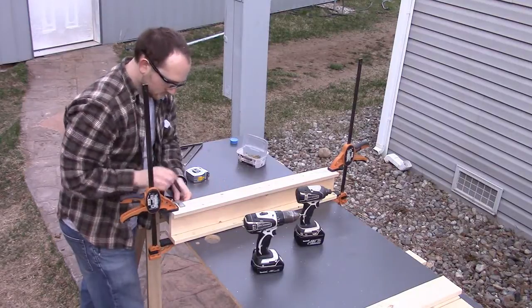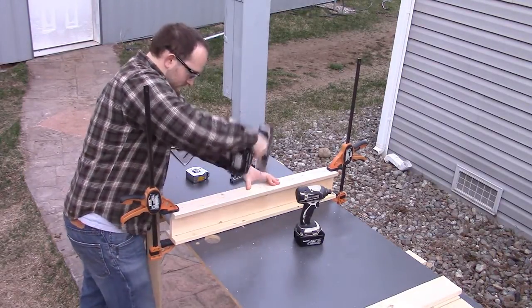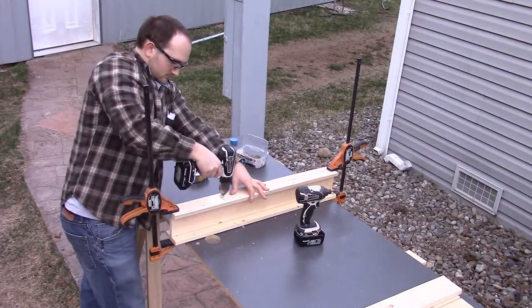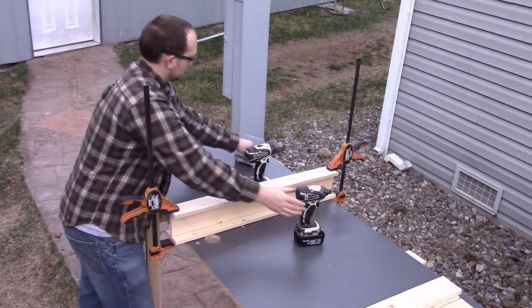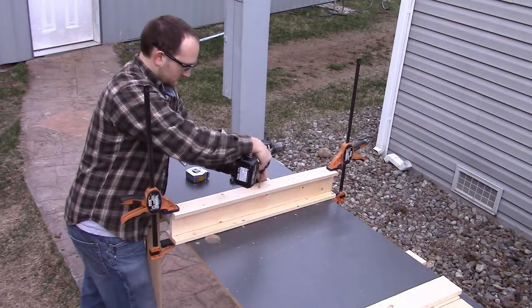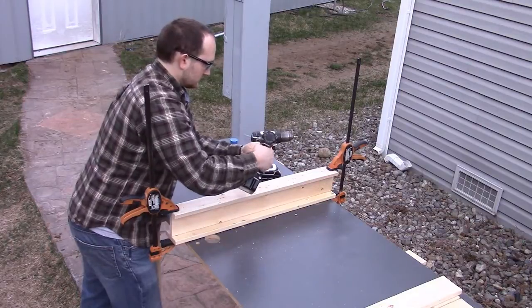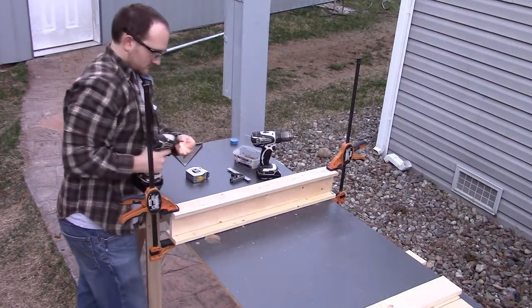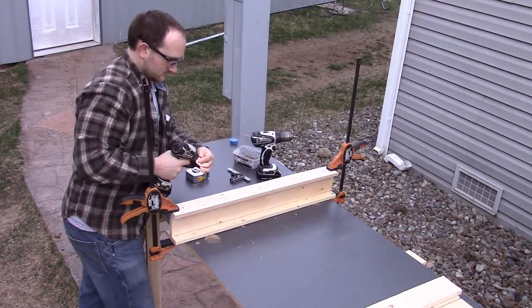Now, something of note: because I don't often fasten an extra board on the top of these, I've picked up the habit of countersinking the top screws an extra 1/4 or 3/8 of an inch, as a sort of compromise to try and protect a blade that's accidentally set too deep. However, as a result, I started countersinking everything on this project like that, and my dad mentioned that maybe that wasn't the best thing. So, just to be clear, sinking your screws too deep will weaken your joints, and since these boards are made of cheap, soft pine, the screws really don't need much help to sit flush with the surface.